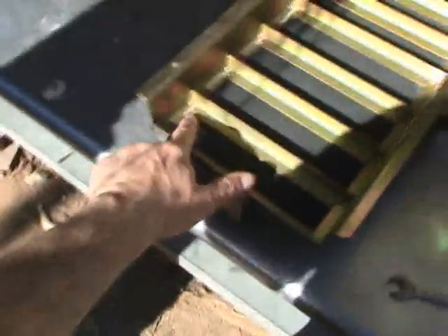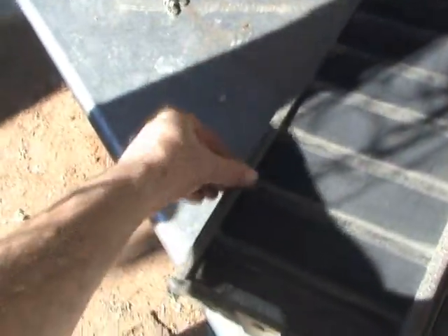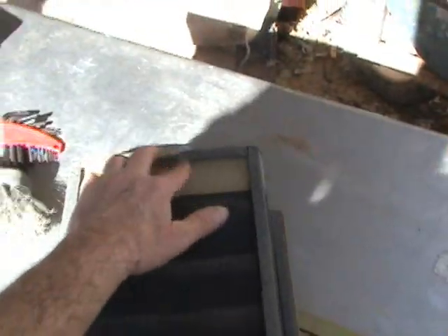This is the whiffle board. You have globs of adhesive on each side. The chief problem is this foam rubber here that is used to help it maintain a somewhat airtight seal, because this is a baffle bellows device. This foam is not going to last very long — you can already see it deforms at the pinch points. I would have used neoprene, thicker rubber, instead of what has been used.